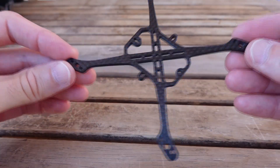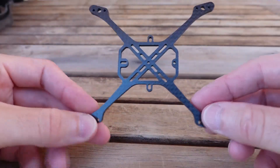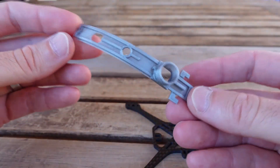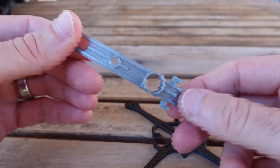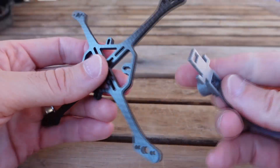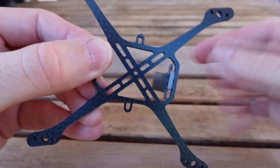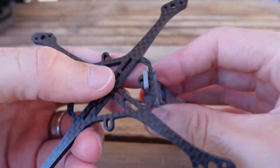That covers the details of the frame. Now let's talk about some of the details of building it up. If you are building it up the way I like — using the printed camera mount — you can get the files for free, with links down below. Print them out in TPU. The first thing you want to do before you start building is go ahead and slip the camera on, because you need your screw to mount your flight controller to come in behind the camera mount.